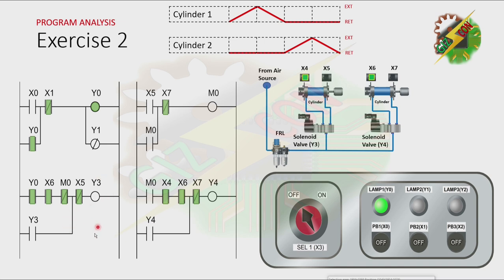And the cycle of this process will repeat. The only way to turn off the process is by turning off Y0. And to turn off Y0, we need to energize X1. Now let's have our simulation. Let's press PB1.